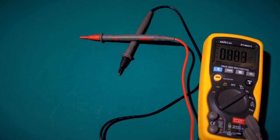Now, if you don't want to mess around with cheap supplies on Amazon and eBay trying to find something that actually isn't suitable at the end of the day, could be dangerous, and we're going to cut open some of those supplies in a minute, there is a solution, because you've got to find a 9 volt supply that really needs to do 1.5 amps output to power that cassette recorder, as well as the Spectrum and that voltage regulator that gets really hot.